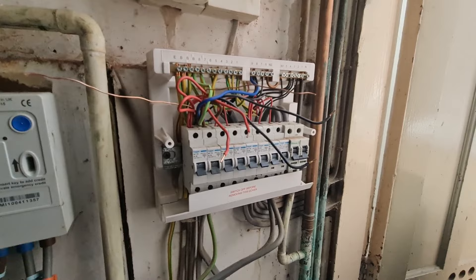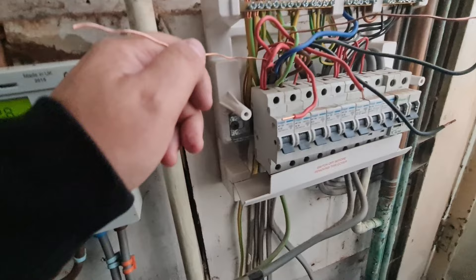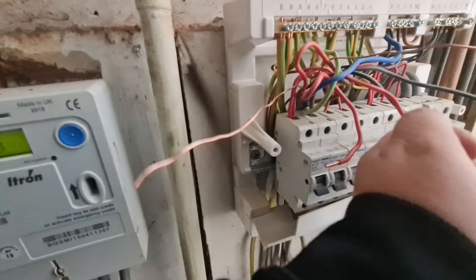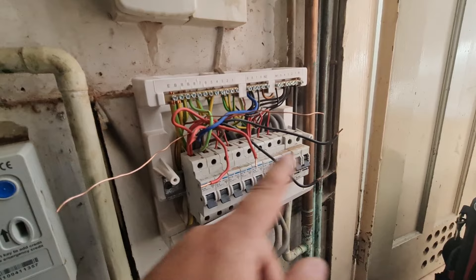We can see the legs of the ring quite clearly here. Bridging over now the line and CPC. We'll call this leg one and the other leg two. You need to take the line from leg two and mix it with the CPC of leg one, and then repeat that on the other cable - the line from leg one to the CPC of leg two, essentially creating a figure of eight. You can include the neutral in a separate figure-of-eight test if you wish. For the results you're entering on your test sheet, this is what's talking about big R1 and R2.